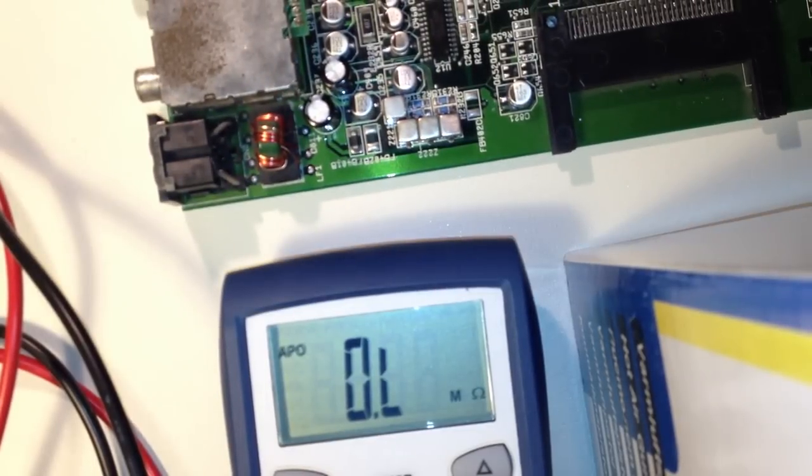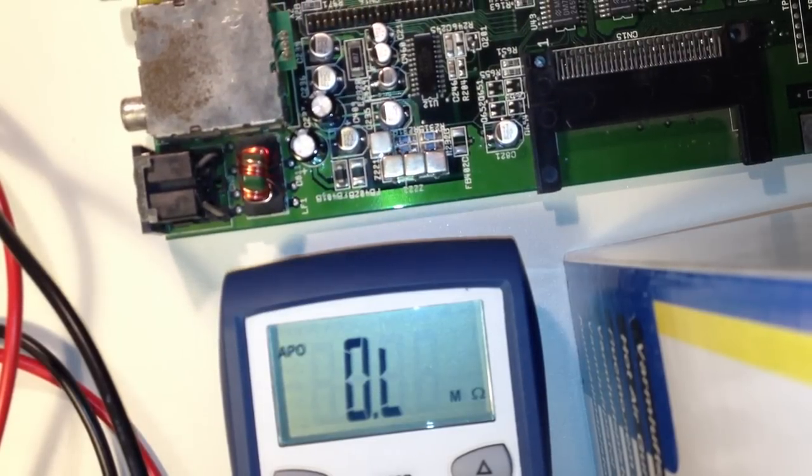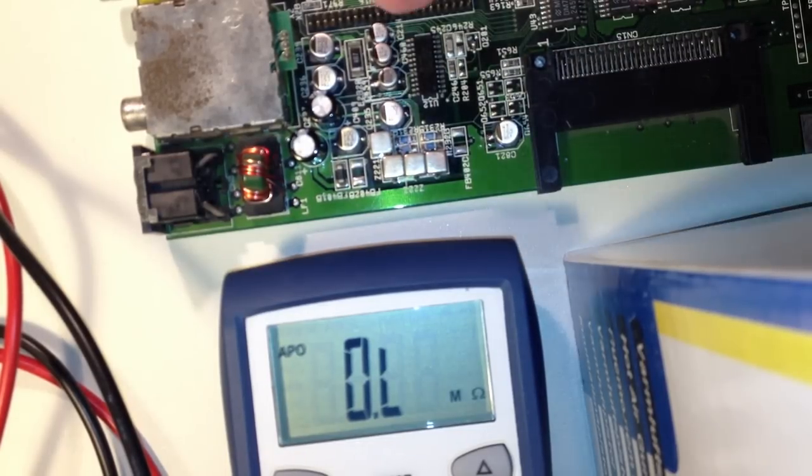You know what I think? I think, and this is my conclusion, that someone has been playing around with this motherboard quite a bit, and I think that person didn't really have a clue about what he was doing. And he desoldered a lot of components, and then he forgot where they were seated. So when he was about to put them back, he put them back in the wrong position. Incredible! I cannot believe this, really. Because these resistors, they have swapped places, some of them, and they cannot do that by themselves. Someone must have done that.